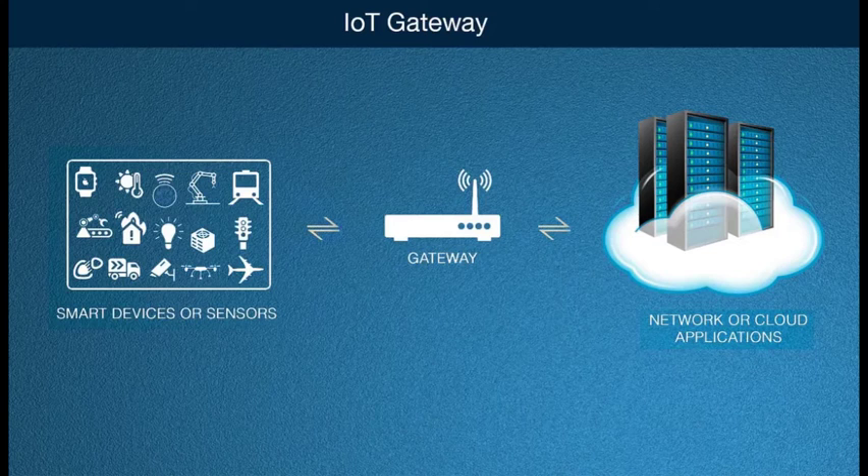Another application is that it has ADC inputs, digital IOs, PWM, and all communication protocols like RS232, I2C, SPI, CAN, and Ethernet, so this can be used in an industrial environment. It can work as an IoT gateway. The only negative point is it doesn't have any WiFi or Bluetooth capability, but that can be easily added via a daughter board.